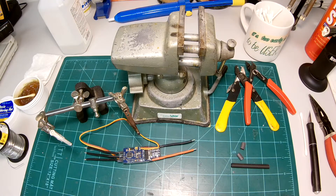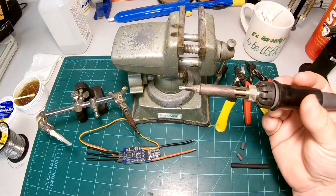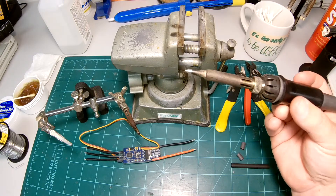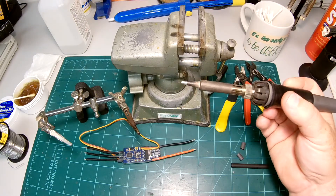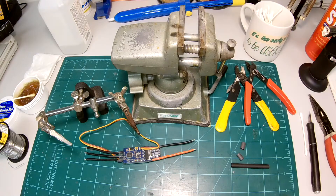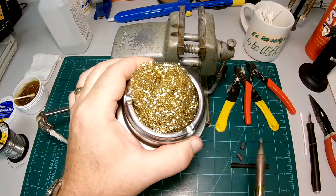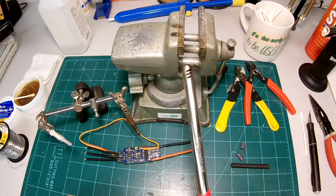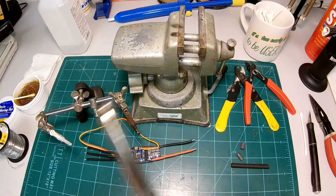You can use several kinds of soldering iron. This is a very old one I've had for over 20 years, but I've taken really good care of it and that tip looks brand new. Highly recommend if you do soldering, make sure you have a sponge and also a tip cleaner — that'll make your equipment last a good long time. And finally, over here is a little lighter for when you're sealing up your shrink tubing.